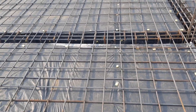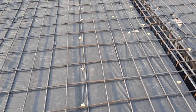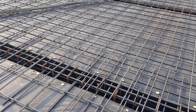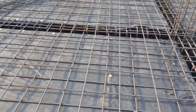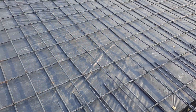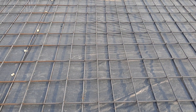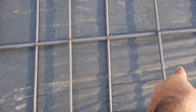In the next video I will guide you for details of the floor beam, and also for columns. This section here is uncompleted — they will place steel rods between these two to make it six by six inches, or 150 by 150 mm.